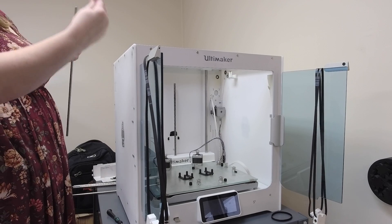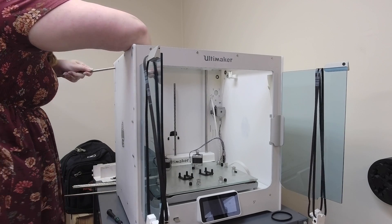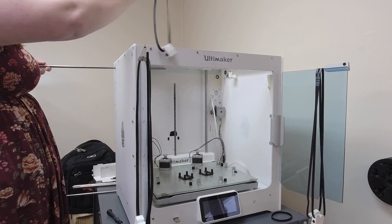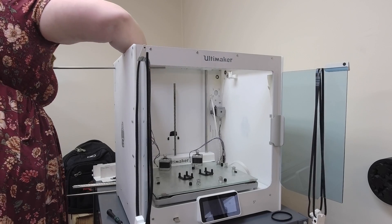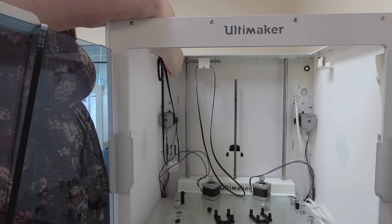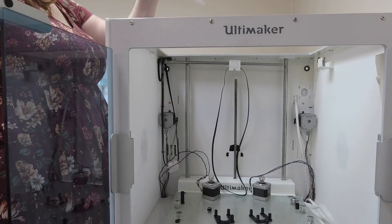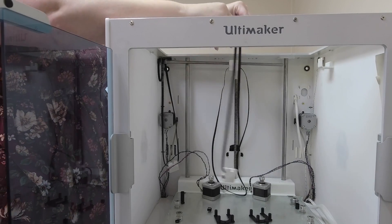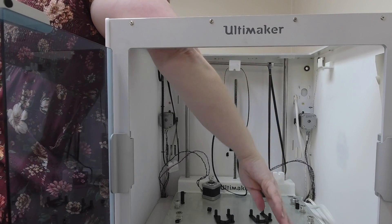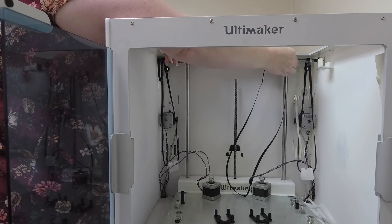Put the short belt on the larger half of the double pulley, place that side towards the panel, and line it up against the frame bearing on the inside of the printer. Slide the perimeter shaft in. Grab one of the 714 belts and hang it on the smaller side of the double pulley. Take one of the 920 belts and spear it onto the perimeter rod. Take one of the 8mm pulleys, hang your 714 belt off of it, slide it on with the wide part of the pulley towards the wall. Add the 8mm spacer onto the end and slide the perimeter rod in further. Make sure to hold the double pulley down so it doesn't pop off, and ensure the rod is centered between the two side panels.